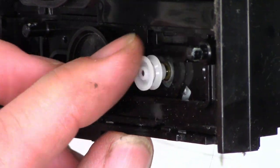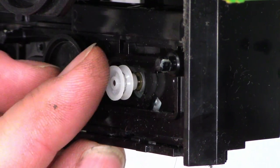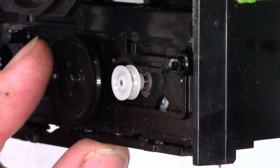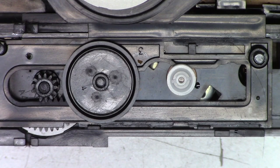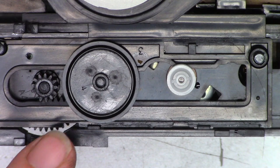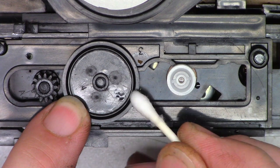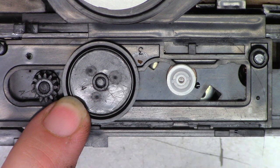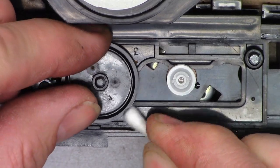Just a little droplet of oil to lubricate the bushing right there. Look how dirty it is in that pulley - I'm going to get a cotton swab and some acetone and clean up both of those pulleys. The first thing I want to do is a test on this pulley to make sure the acetone is not going to eat it. I'm just going to rub it around, and if it comes up black it did not - so I know we're safe to clean it with acetone.